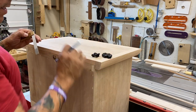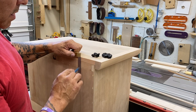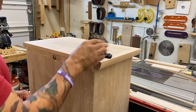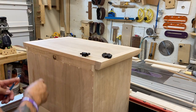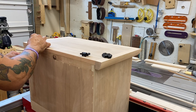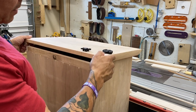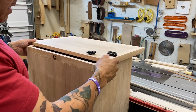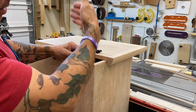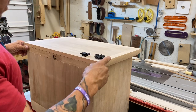So let's get started. I'm going to mark these out. I've got this centered, there's a little bit of clearance here. I'm going off centers when I do these — center of the hinge, whichever one I use. Now what's cool about the Soss hinge is you can use it for inset doors or overlay. So this is basically an overlay because it's overlaying — it's not inside. If this was inside the edge, a lot of different applications. Very cool hinge.